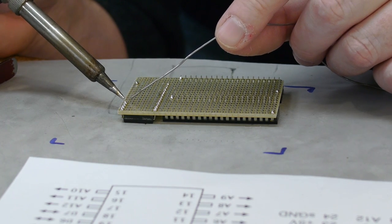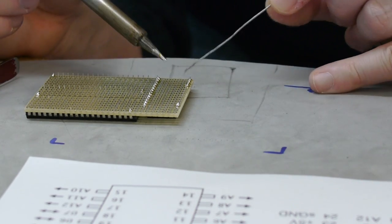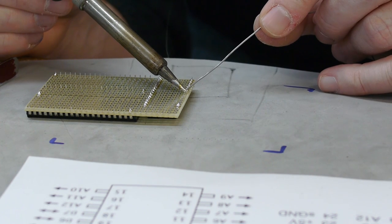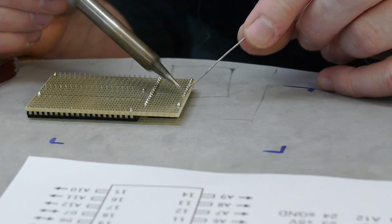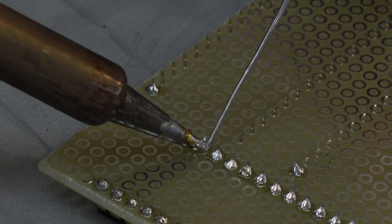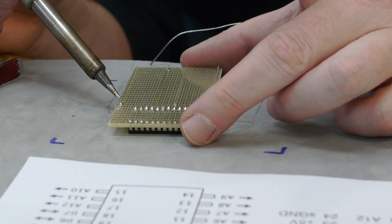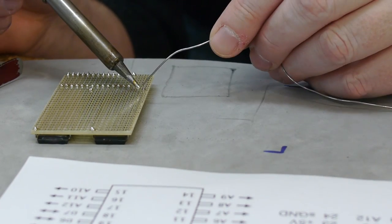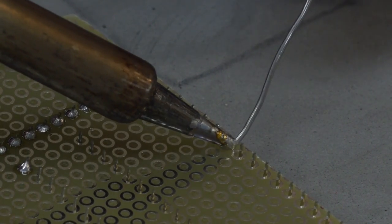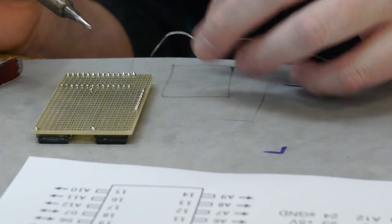On this side it's a little harder because the pin is over on the right side of the via. So if I turn it like this, I can actually get more surface area. Since I'm right-handed, my iron hits both the pad and the pin, and that makes it a little easier because you can apply heat over a greater area. This is not a good solder joint, so you always want to make sure that the solder completely flows around the pin. That's why it's good not to hit the pad on the edge, but actually get it on the inside, to make sure the solder flows all around it. Because usually it's the gap of the drilled hole that causes the solder to not fully form.